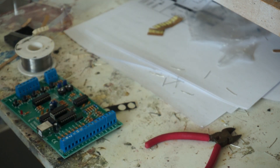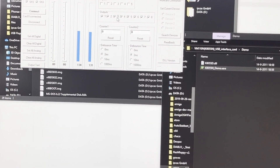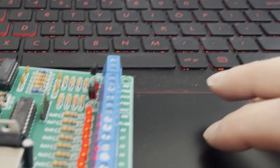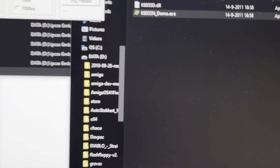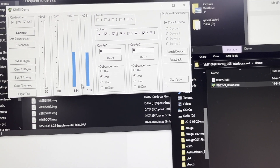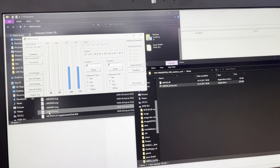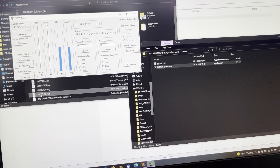To make sure it actually worked, I did rely on Windows first, because I know that application works, so I can test it before moving to Linux. The analog values need tuning — those should be at 128, so they're a bit high. That's why we have the potentiometers here, we can tweak those. And I soldered it correctly in one go.